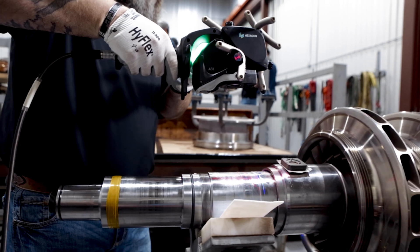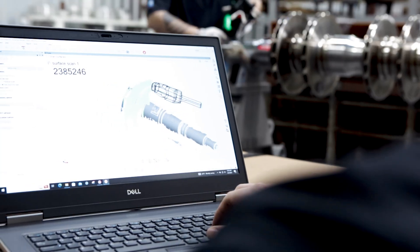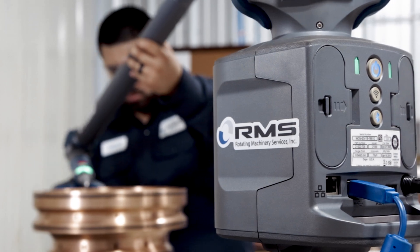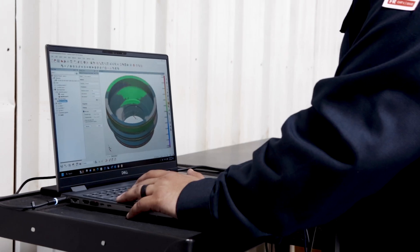It's not necessary to rotate rotors to perform shaft end alignment. We can even now digitally dowel components in order to replicate their relative position and alignment with any object in space, whether that's in the field or in the shop.